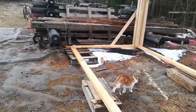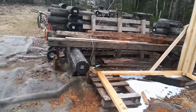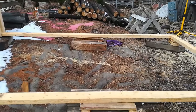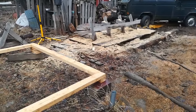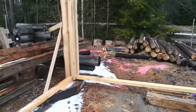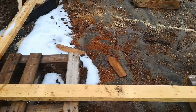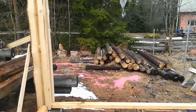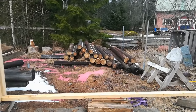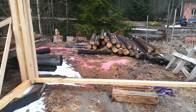We're going to have a door in this side, so there'll be a corner post and then a post where the door starts, a post on the other side of the door, then a slightly longer run to the corner, and I'll mirror that on the back wall. So opposite the post for the door on the left-hand side, there'll be another post directly opposite. Same again on the other side of the door, so that it's easier to tie them all together at the top. You'll see how that works.